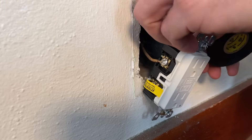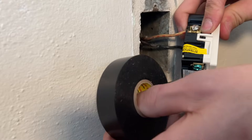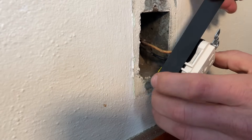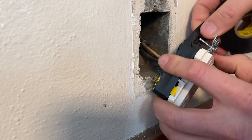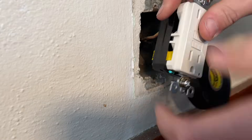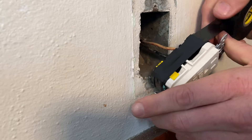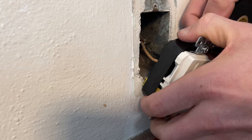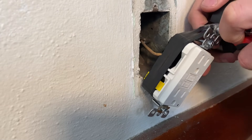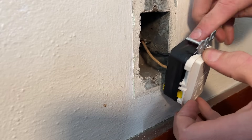Before placing the GFCI outlet in the metal box, because it's so tight, I'm actually going to wrap it with 3M Super 33 Plus electrical tape — best tape on the market, and you can see the link in the description. I'll do two wraps, stretching the electrical tape as I go on the outside, which will help bond the tape and also contour to the receptacle housing. At the end, instead of stretching it, I'll just cut that off with some micro side cutters — at the tail end of the tape you don't want to stretch it, you just want to lay it back down and adhere it to the wrap.